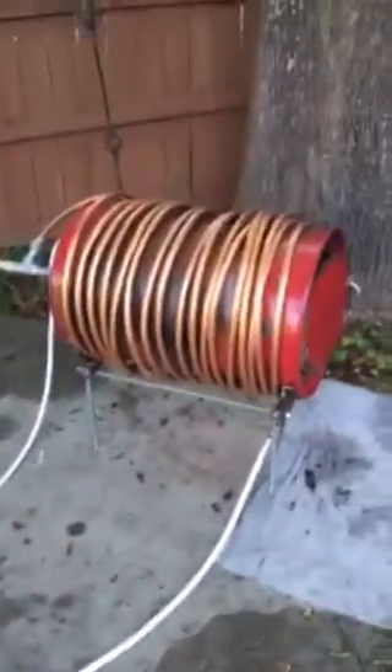Here's version two of my hot water heater for my pool — or water heater, I guess. The idea is to take a 30-gallon steel drum, and I have fabricated a heating coil on the inside made of heavy gauge stainless steel tubing. That coil alone weighs about 50 pounds.